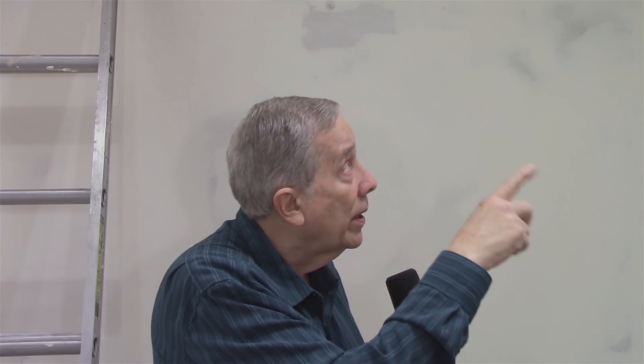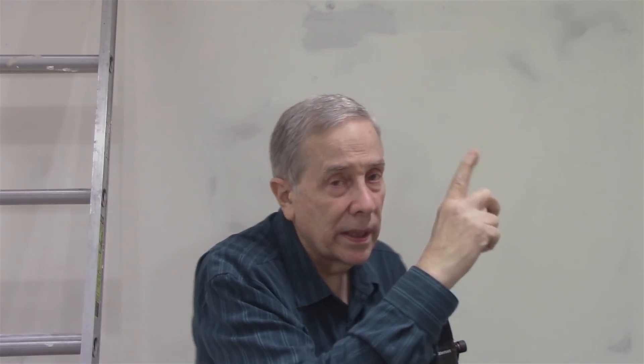The other thing I did was to put light switches at the entrance. There is also a scuttle in the ceiling to provide attic access. It is a little on the small side — it's supposed to be 22 by 30, but it's not a required scuttle, so that's what it is.